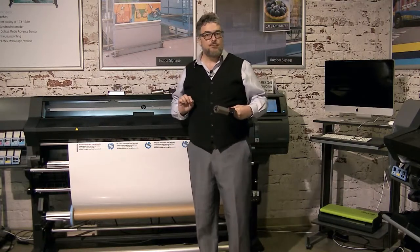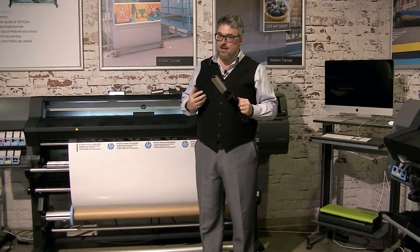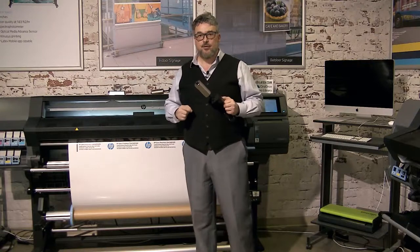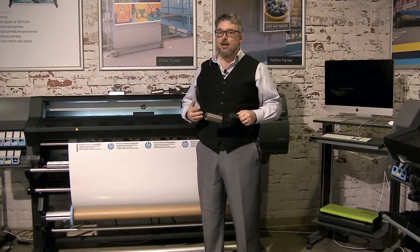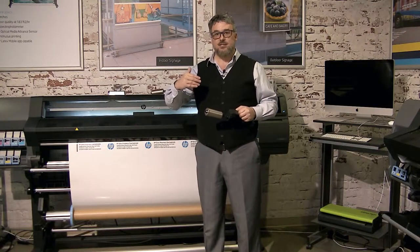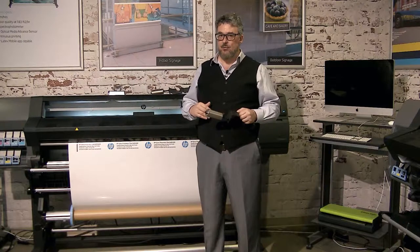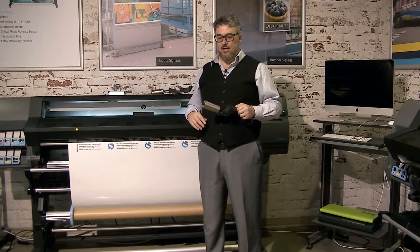You may run into certain medias, however — like I ran a product by Aurora called Sticky Stuff and it was very thick — and I definitely needed to have this up a little bit, because putting them all the way back put so little tension that it did work, but it was pretty close to having some issues because the material would have benefited from just a little more or less on the counterweight. These are key to panel printing on a 300 series. I definitely recommend ordering them. If you do not have them and you're doing panel jobs, I think that's a mistake.